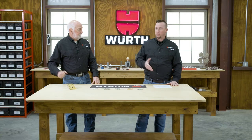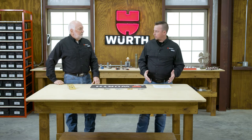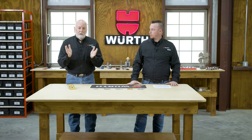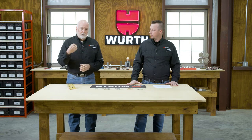Okay, now we have to talk about the mechanical properties of rivets. Right, the mechanical strengths involved with this. And typically, we're worried about shear and not tensile. Correct. Unlike a lot of the fasteners we've been talking to you about, rivets are primarily in lighter applications where shear is your primary concern. You're tacking two light gauge metals together or small plastic pieces together. Shear is primary. Now, if you do get into more clamp load requirement, tensile requirement, then you want to go into other types of rivets, structural type rivets, and they are in existence also. That's just not what we're focusing on today. We're focusing on the basic blind rivet.